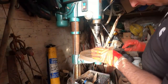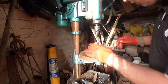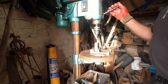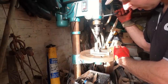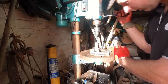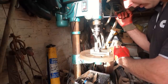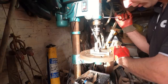Make sure that's nice and tight. Like so. Oh, drill's actually at the perfect height. There we go. Right, now we've got to just drill all the way down with the 7.5mm bit in there, and then I'll tap the top of it so that I can screw a grease nipple in there. Then, of course, I can keep the pins greased, and it won't go like what the others have done, and wear out the top and the pins themselves.